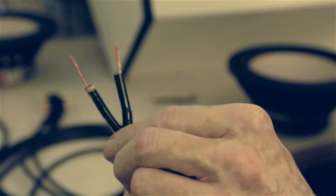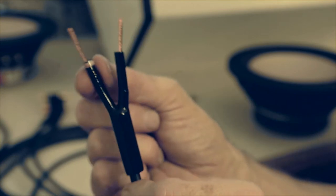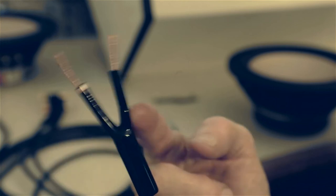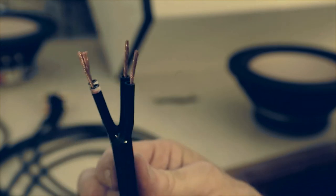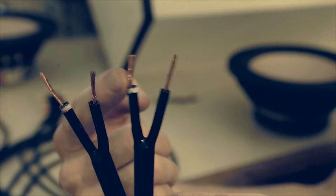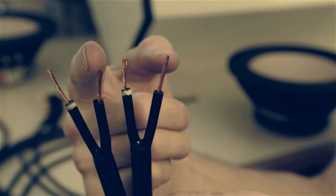I'll show you that with these. I have these really cool insulators — you can see that wire could cross over, so I've got these insulators called wire pants. It has two legs in its center and it keeps these from touching each other. So you can see the insulator is bulging out a little. That's the plus on the ends. If you're going to run two of them, you run them opposite. I've already marked these with white paint. The white here — this will be the outer core for one and the inner core for the other cable. You put those together for your plus, and then inner and outer cores opposites for your minus. You run them double.